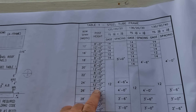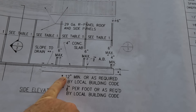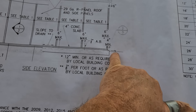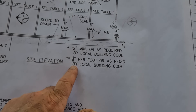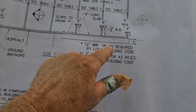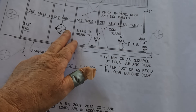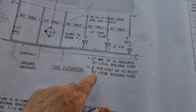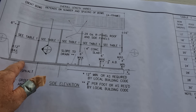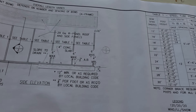Here's your post height, your span — this asterisk right here. There's a note with an asterisk: 12-inch minimal, so right here is your depth of your foundation. They also want slope on this because it's not fully enclosed — one side is partially open and the two ends are open. So rain and weather can get inside, so they do want some drainage: one-eighth inch per foot, or as required by local building code.